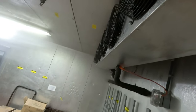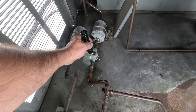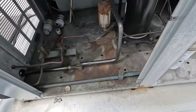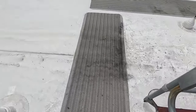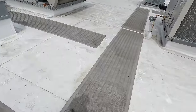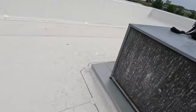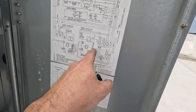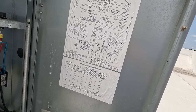We're going to check if we can find out anything on the programming — termination temperature and stuff like that. We need to find out if that's why they had that limit switch in there. The limit switch would break it out of defrost, but it terminated on its own before. The heater limit might be a fail safe — that's going to kick it out of defrost — but otherwise it should be done by the board. That's how every time I've seen it work.